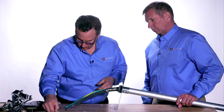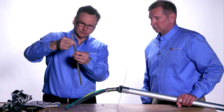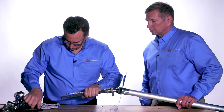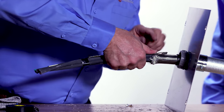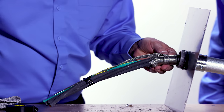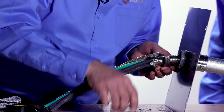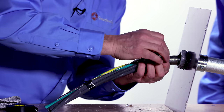The next step is to apply the braid. Make a 45-degree fold with enough excess to wrap around the cable. Use needle nose pliers to smash it down. Keep that braid termination strap as short as possible. Wrap the braid all the way around the cable, then make a 45-degree cut so the braid does not overlap on itself. This provides your 360-degree termination.